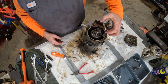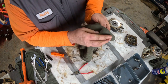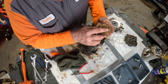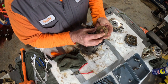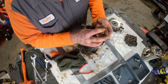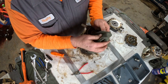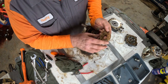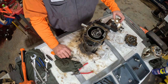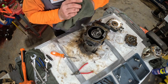This is the piston plate. The piston group runs on the piston plate. You can see there's a little bit of wear on this. The main thing you want to check is that your fingernail does not catch on the piston plate. This one's in pretty good shape. We're just doing an inspection on this because this is off of the machine that we're rehabbing — you want to make sure that the pumps are in good shape. If we're going to sell it, I don't want there to be any issues.